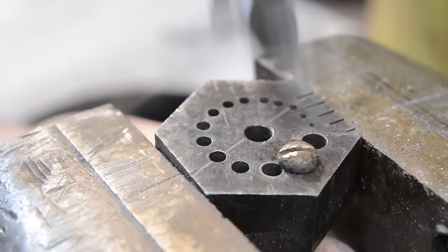So do that to the rest of the screws. Polish them all down. Here we have a pile of polished up screws. Fire blue them all. Here's the steady lineup of all of them after they've been blued. And then if you're wondering how to do those little itty bitty screws in the back, take your trusty screw plate. You've got one for number 6, number 8, number 10, 12, blah, blah, blah. Thread that screw into the 8-40 screw hole. Kiss it on the Scotch-Brite wheel. And voila, a polished screw head. And go ahead and do it with the fire too.